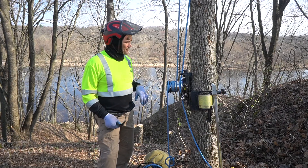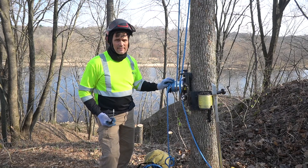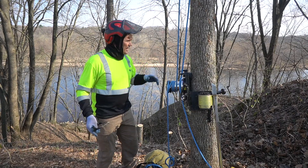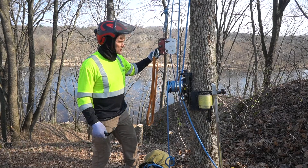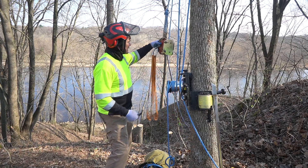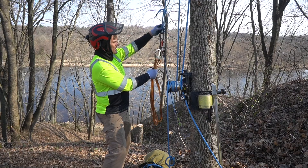So I went up and adjusted the pulleys today and got those arranged correctly, and we moved our GRCS tool into a different angle so those ropes are not coming in contact with each other. We have two ropes — 300-foot ropes — we bought a 600-foot spool and cut it in half. We've got this rigging plate that I had designed years ago; I had a machinist for a brother-in-law and he put it together. It's really heavy so it runs down the line all by itself nicely, and it's got two pulleys so it runs level, with a big clevis right in the middle that we put our slings on.